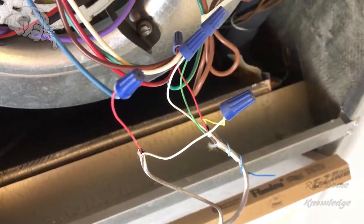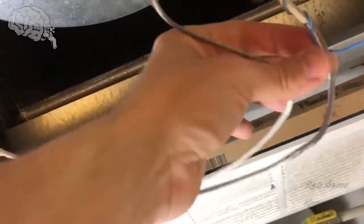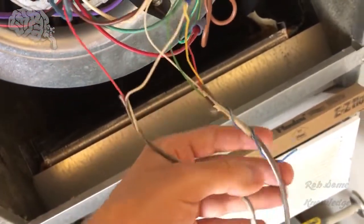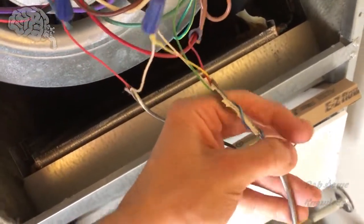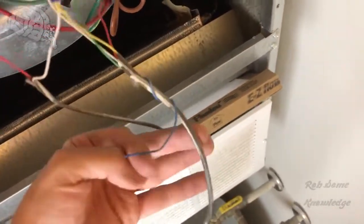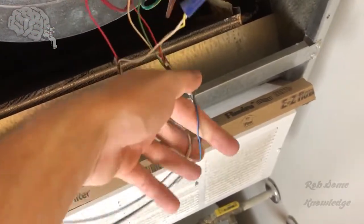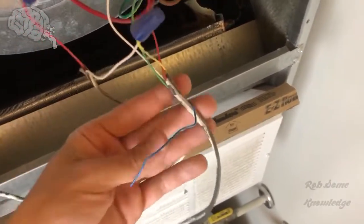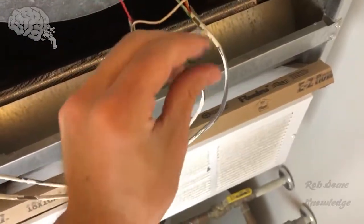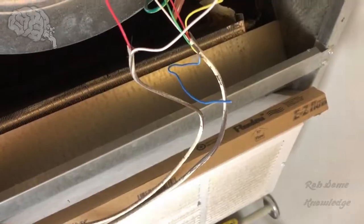So firstly we're going to find our C wire. All of these are connected except for one loose one, which is a blue one — the typical color of a C wire, though not always if the installer doesn't follow the standard wire color coding. That's why you should always double check, but I already know this is the C wire. This is the unused one on the thermostat that is tucked back into the wall. It's wrapped up unused around the big cable, which is fine — we're going to unwrap that and get it stripped.